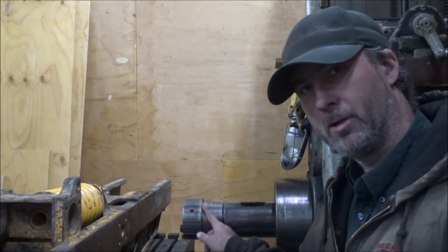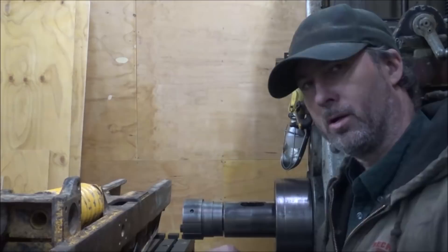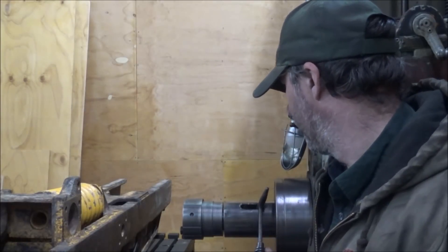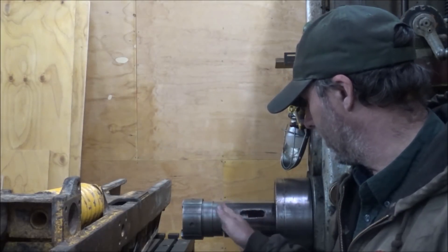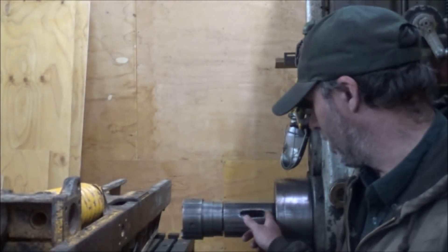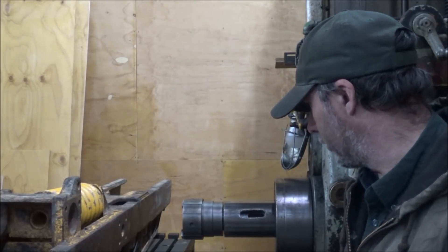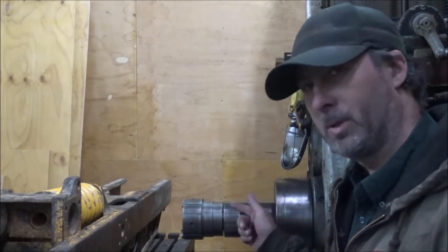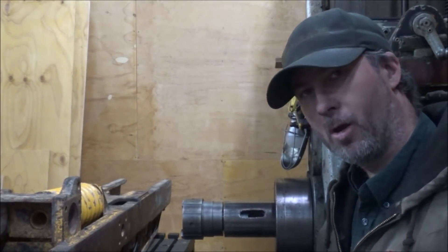In order for me to be able to use this bigger Beaver tool holder in my mill, I'm going to have to do something about this slot and the spindle to hold the key in. Obviously, over the years this has been rigged — as they've cut this back, they've just elongated the slot further and further in order to tighten the holder up, which also means they've cut the holder holes way out. And I'm not super keen on that.